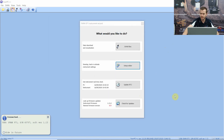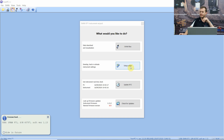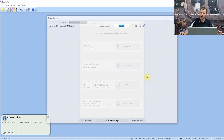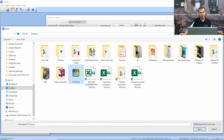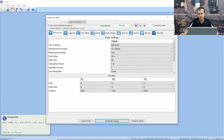You can always reload this onto the instrument - let me show you how to do that. For example, disconnect the 971 and connect it back up again and the wizard will pop up once more. If you've given the instrument to a client and they've cleared all the data and you're worried about recreating the measurement setup, open the Setup Editor, press the open file icon at the top, select your setup file '971 audio' from the desktop, press OK, and then at the bottom press Activate Setup. This is really handy if you've got multiple instruments or after a factory reset.